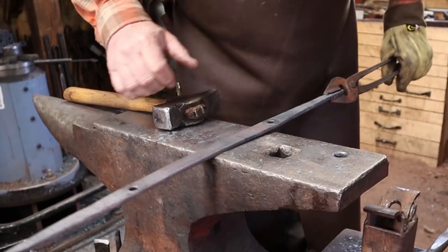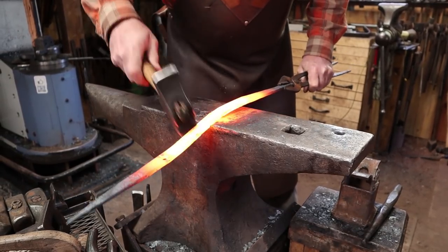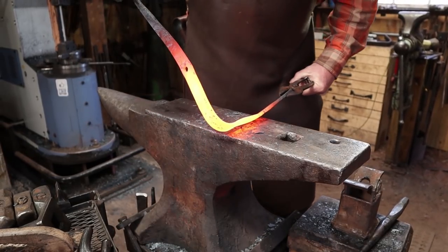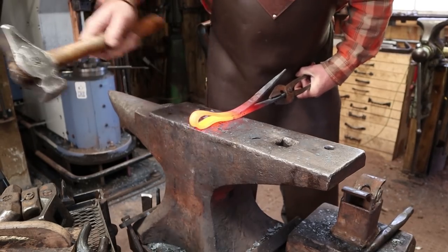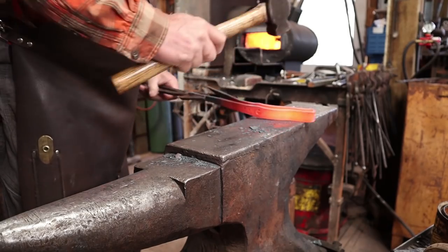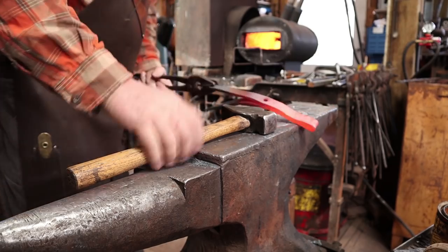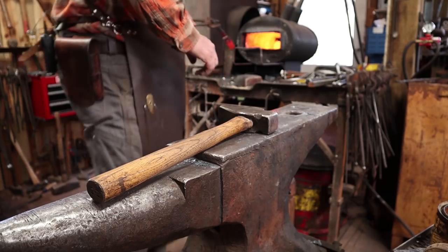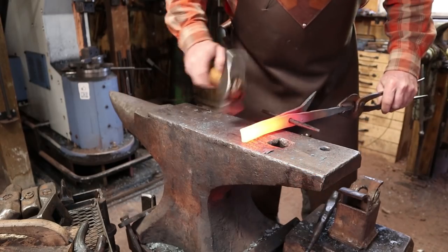The next thing I'm going to do is go ahead and fold this in half with my center punch mark right in the center of that fold. It's a little bit long of a heat, which will make this more problematic as it gets rolled up — we can just put the bend in there. On the other hand, that looks pretty good. At this point I'm more concerned that my two holes line up, because it will be easier to line them up in the end if they line up now. I may drive a drift through there before we're all done just to make sure they are lining up. Those look like they're going to line up pretty well.